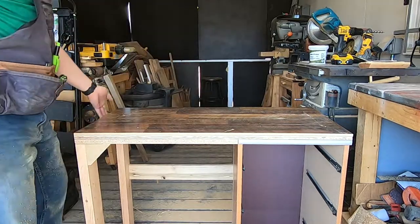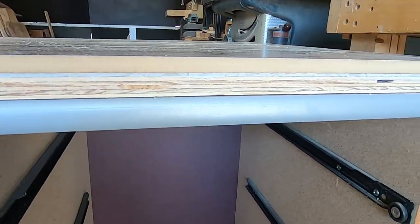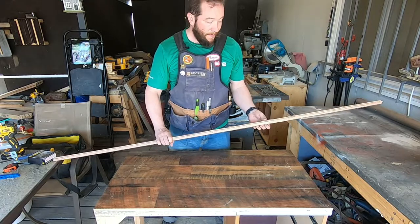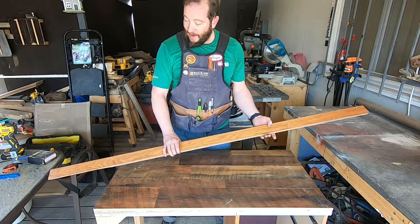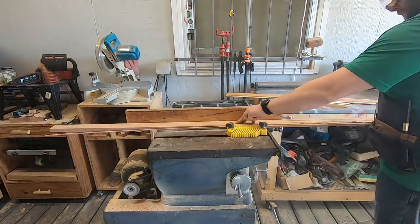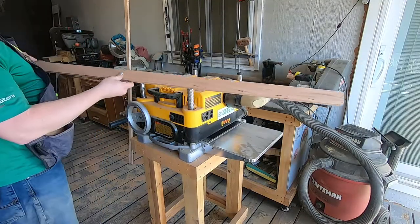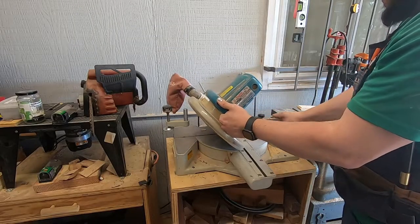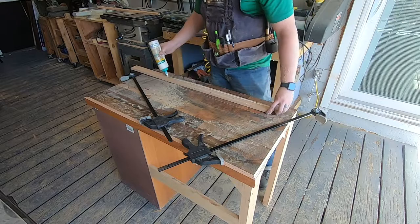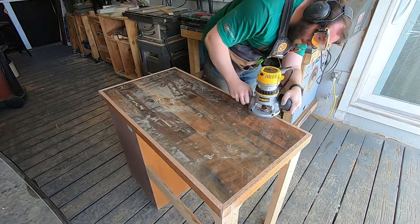Nice and smooth all the way around. It may be smooth but with the layers it's a little ugly, even for this project — let's see if we can cover that up. For the hardwood edge banding I'm going to be using this solid oak — actually oak flooring. A friend of mine happened to be renovating their house and they had some in their dumpster, and I asked pretty please if I could have some. Most wood flooring is also tongue and groove so I had to rip down both edges to width. Then I ran it through the planer to admire that surface finish on the bottom. I set my miter saw to 45 degrees and cut them all to length, then with a little bit of glue and brad nails stuck them in place. I repeated the process on all four sides and then used a 45-degree chamfer bit to soften the edges.